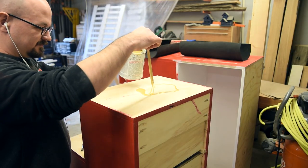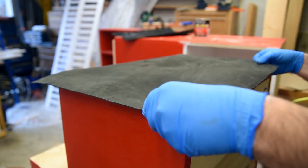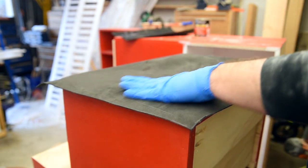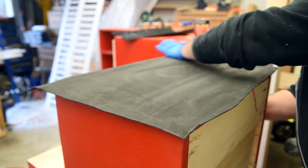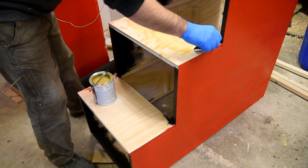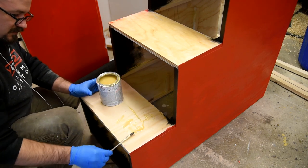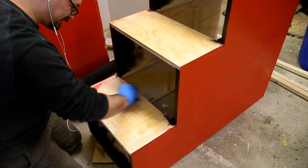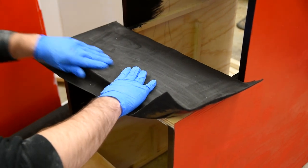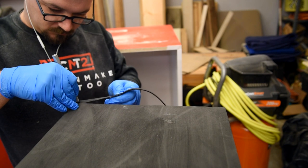Now for adding the cushion to the stair tread. I ordered some 2mm EVA foam for this — my goal was something soft enough for bare feet to be comfortable on, but with enough grip that socks wouldn't slide. To attach it, I used contact cement, spreading a liberal amount on both sides and using an offcut of the foam to spread it around. After about 15 minutes the surface is tacky, and that's when the two pieces go together and create a permanent bond. I cut everything oversized and then trimmed the foam to fit after I had it in place.